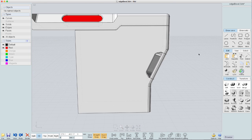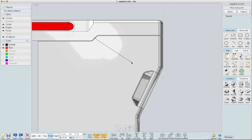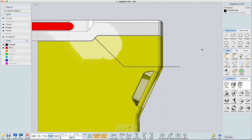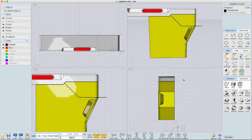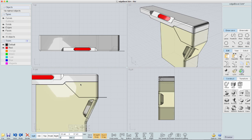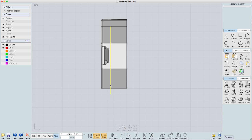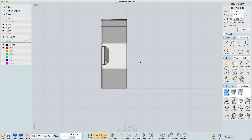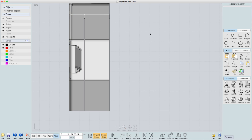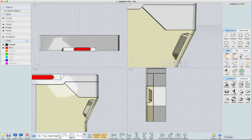There's my handle. From here on it's pretty much an exercise in dividing up the geometry. I'm going to create a set of parting lines again, fillet the intersection at two millimeters. Then I do the offset — and I'm not going to subtract this all the way through — so I go to the side view to make sure I know exactly what I want to cut. Then I do the offset with cap lines and use it to boolean subtract, so now I've got that front face created, and then I quickly add this little quadrant up here.